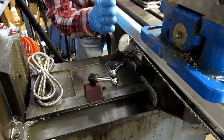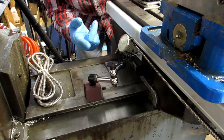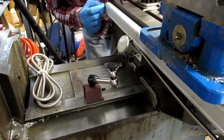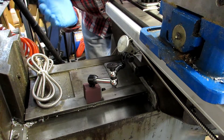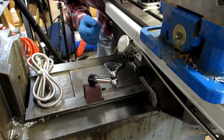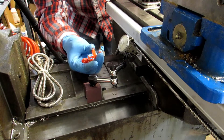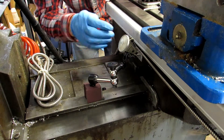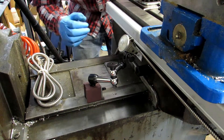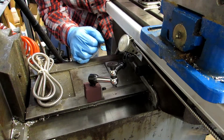I'm all set up now to sweep in the scale up and down. When I have to adjust this I'm going to leave one of the mounting screws pretty tight and loosen the other one and do all my adjustments from that end — that way it's swiveling on the tighter screw and I won't have to chase my tail going back and forth. I've removed the red shipping clips from the reader head so they won't interfere with the dial indicator reading, but don't throw these away yet — you need them to set the spacing on the reader head.